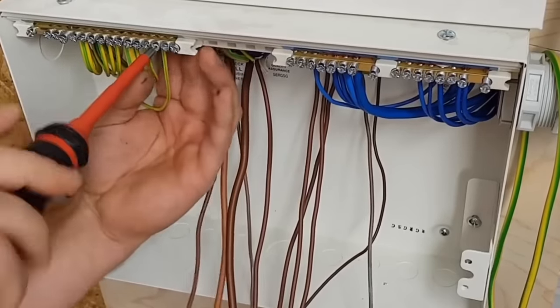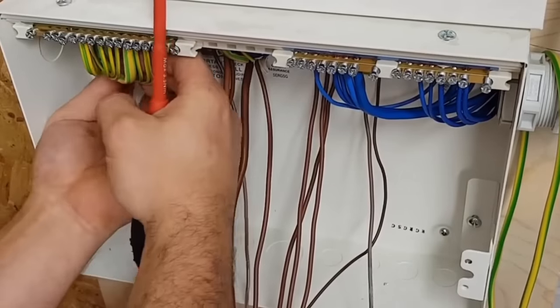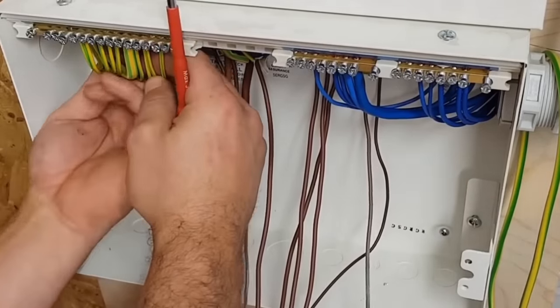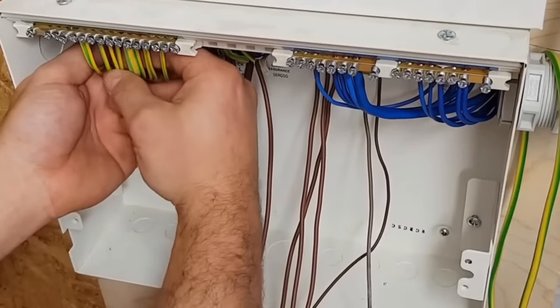Yeah, Joe, in defence of Luke, this consumer unit has been used many times, and what we're finding is that distribution boards are designed to be installed once, tested at intervals of 10 years, and not have those terminations undone, whereas this board's been on, off.